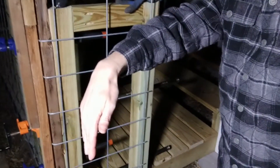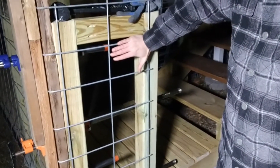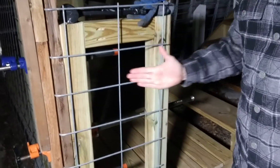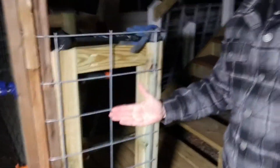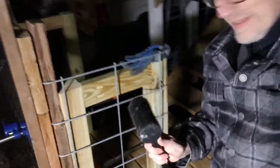Then coming over here, this is the piece I wanted to bend, so it was coming out here initially. Once I got all this clamped down as tight as I could get it, I started shoving on this part of the panel and I got it to about a little past 45 degrees. Then I took my dead blow hammer and hammered right here on these parts of the bend.